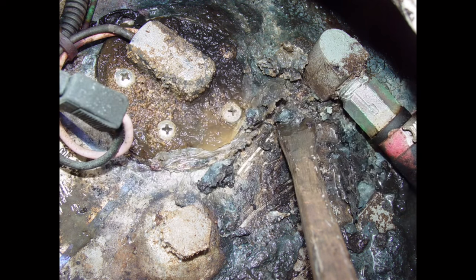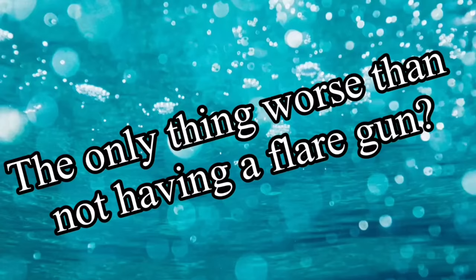In the meantime, always make sure that your openings, your deck access plates or panels are properly sealed and the O-rings are in place and in good condition. If your cockpit deck has removable panels or plates, these should also be periodically removed, maybe every 5 to 7 years, so that you can not only check the fuel tank, but you also can renew the caulking around the cockpit deck panel to ensure that it's not allowing water to leak onto the fuel tank.